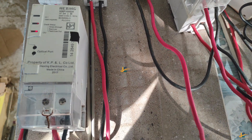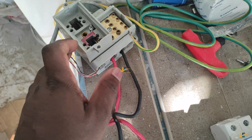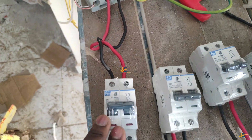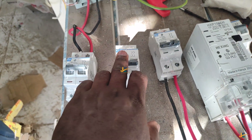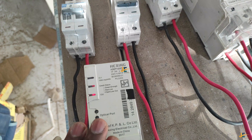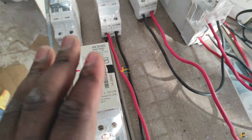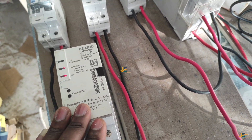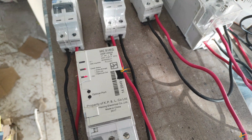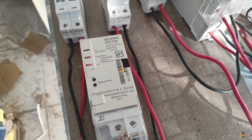This is my demonstrating cutout. This is the first double pole for this meter and the second double pole. I said this is the perfect way of terminating these prepaid energy meters, especially in a standalone residential home. However, when terminating multiple meters, you can use one double pole. If you haven't watched our video on how to terminate a prepaid energy meter properly, check out our previous videos.